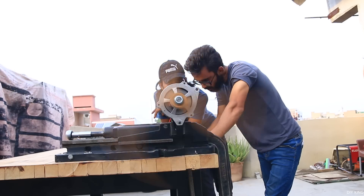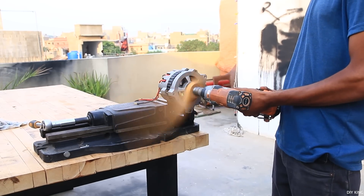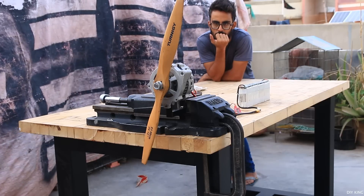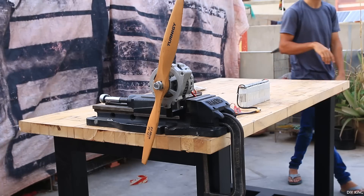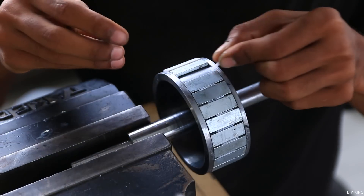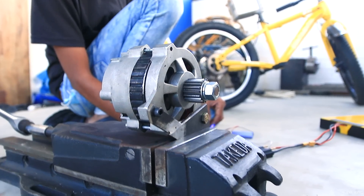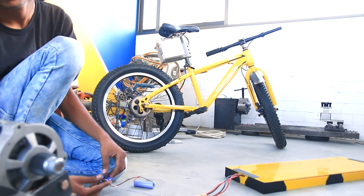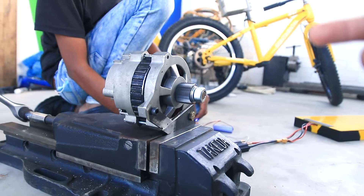Compared to a gasoline engine, this thing offered instant power — a great feature of electric systems. It's our first time converting a car alternator into something more useful for us, so I guess we should call it a success. We'll try to find out why it's drawing so much power without any load, as everything is running smoothly without excessive vibration. This might be an issue related to the width of the magnetic poles on the rotor. We're curious to see if this car alternator after conversion can be a powerful brushless motor — for that we're going to convert our bike into an electric one, so stay tuned and we'll see you next week.